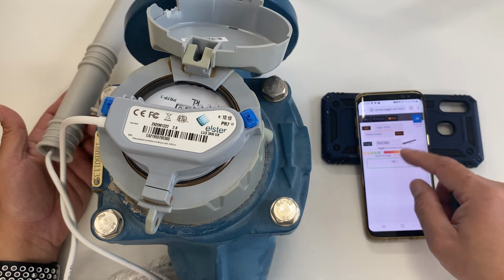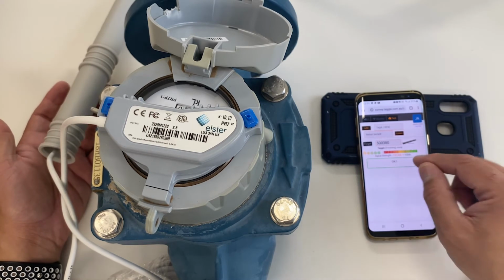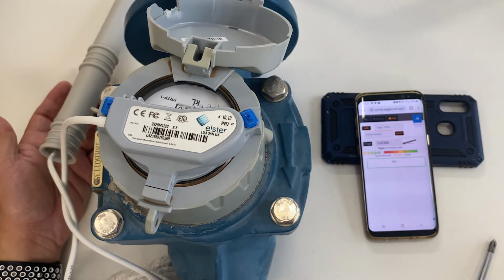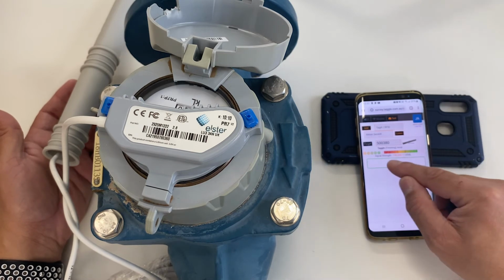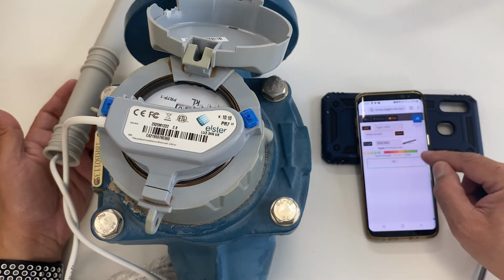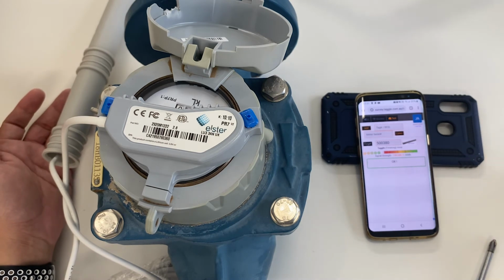Now, the reason why we're getting red here where I am right now in the office of Taggle is because there's a receiver a bit far from our office, and we're still getting reception from that receiver. But we usually recommend that it should be only from the orange up to the green. So that's about negative 130 dB to negative 75 or 65 or even lower.